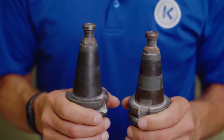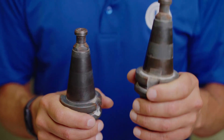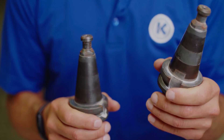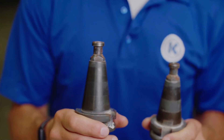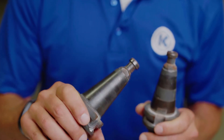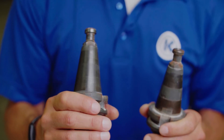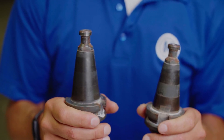In this example there are two cones of very similar age — one before cleaning and one after. This cone here has been removed from the machine, has contaminants and particulate buildup and needs to be cleaned. On this cone, like the pull stud, we used a scotch-brite or non-abrasive pad to clean the cone up, removing all that particulate and leaving a nice clean smooth finish where the taper makes contact with the spindle. This is what you want your used cones to look like for good operation.